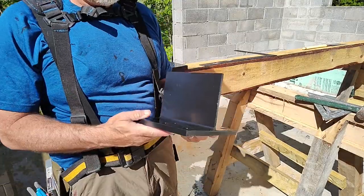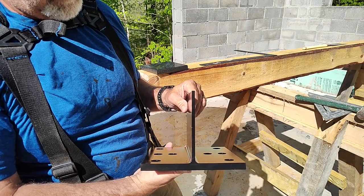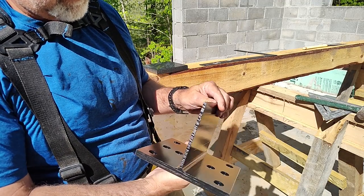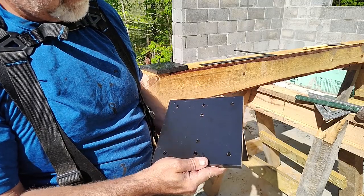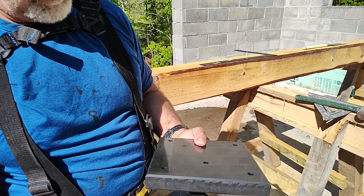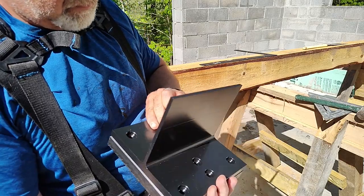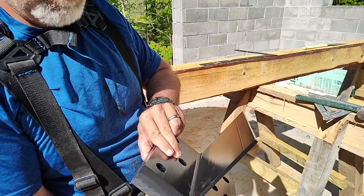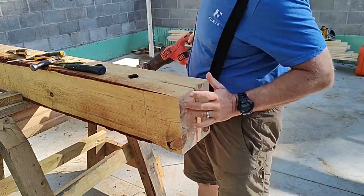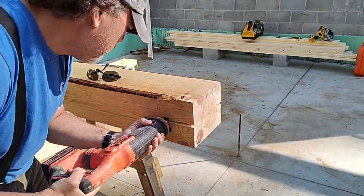These are the connectors I'm using — it's Connext with an X, I'll put something in the description. It's a quarter-inch knife plate with eight holes, but six are used with the riser. This is a one-inch composite riser you can get with it. Code requires that anything non-treated be at least an inch off concrete, and this is what ensures that. Overall, not too bad to work with — I like the product and will probably use it again. It's probably better for outdoor use but it certainly suits my needs here.